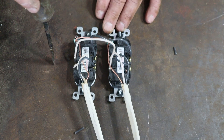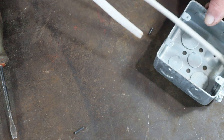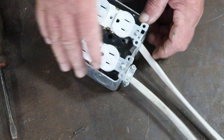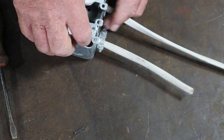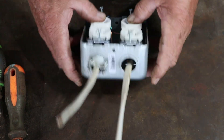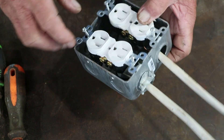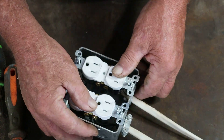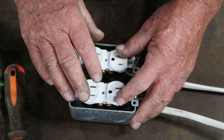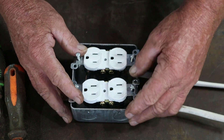This is the proper way to wire two 110-volt, 15-amp receptacles in your home. Now let's flip it over and get it into the box. Of course in a real installation this box would already be pre-installed in the wall. Make sure you have plenty of clearance in the back and that none of the wires are pinched, cut, or touching each other — that is critical to prevent any possibility of shocks or fires. If you turn the breaker on after installation and it trips, that means you have a wire shorting somewhere or something touching that it shouldn't be.